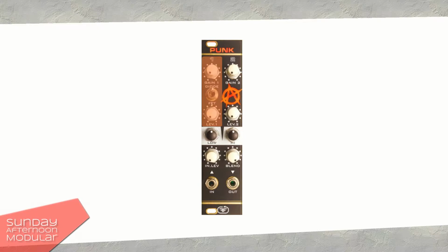Number one is based on a classic guitar pedal distortion fuzz with a switchable diode or MOSFET distortion. Number two is a FET preamp based on a classic circuit of a mini portable cassette recorder and mixer combo from the 80s. Both circuits have their own gain control. You can use only one circuit or mix them together as you like.